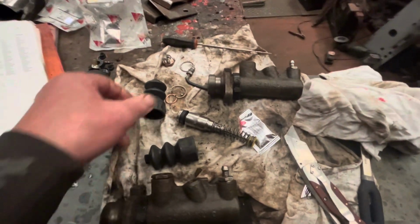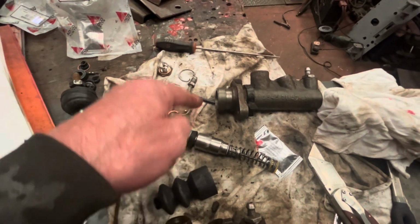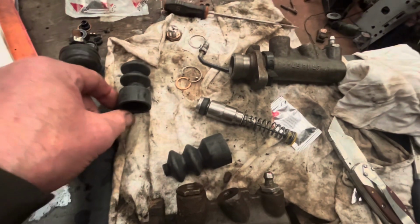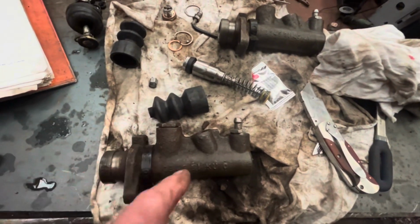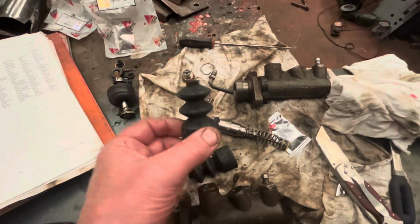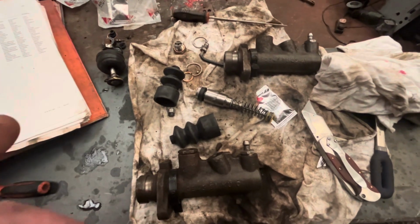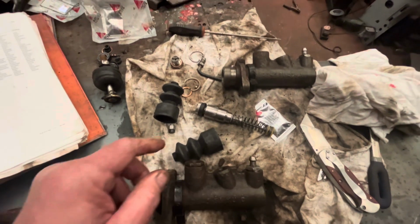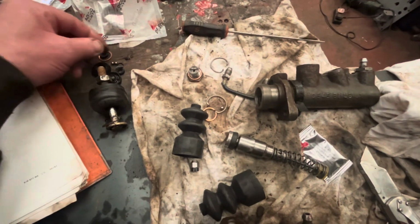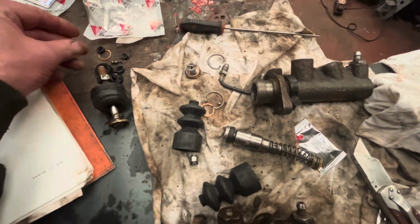Let's get back to this. Get these reassembled and grease up that. Put it in, we can drop the ball bearing in the hole, put the little plunger in, cap on the top with a new washer, and then reassemble it, ready to go back together. I've just got new rubber boots to go on the rods, and we will just check what oil is used in there. Somebody said it could be contamination from the wrong oil that's caused those seals to go all squishy and horrible. So let's get this lot reassembled.